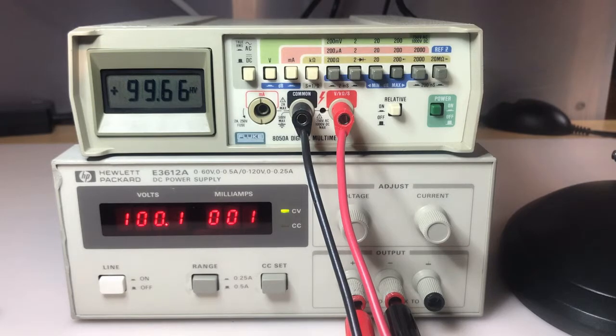So next we'll do resistance, and for that I'll just get a few resistors, I guess. I have some 8 ohm power resistors. I suppose I have 4 of those. I can do one and then connect some in series to get up to 32 ohms, so that'd be good. So we'll start with that.